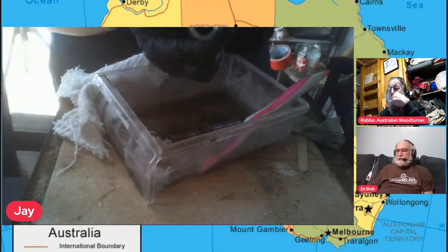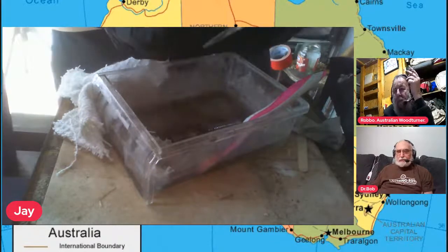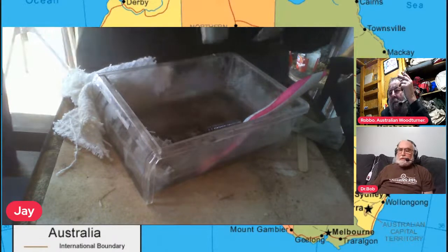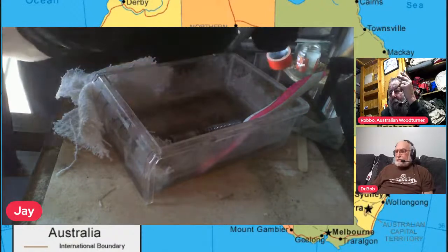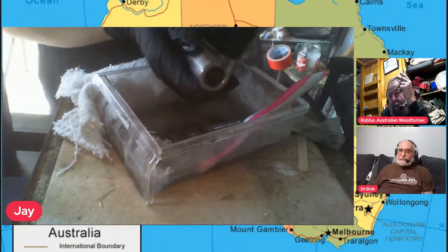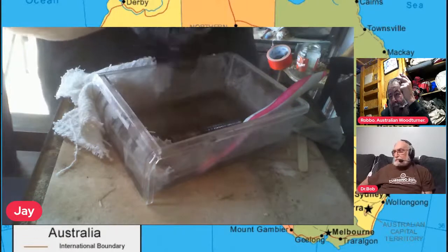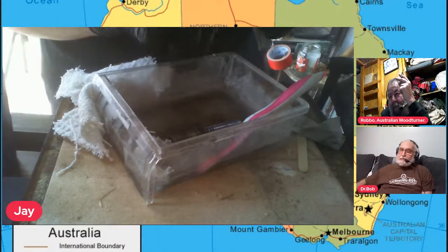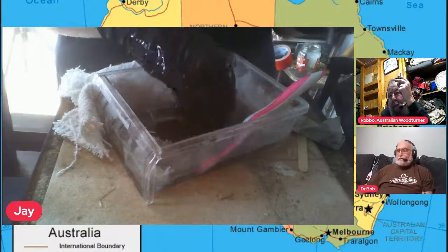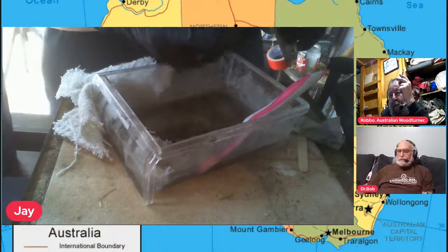The other problem I find that turners do when it comes to the tailstock and quill assembly is the set screw on the wheel. Most quills have a flat spot for that to fit in. Yeah, that's what this one is, a keyway, to guide it in and out, but they don't try to fix it. And the keyway itself, on a lot of lathes, is a physical key that sits in there. Now it's just a set screw.